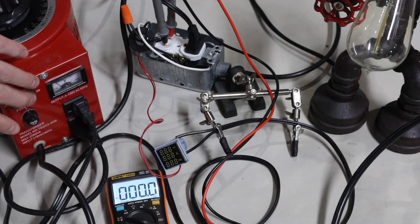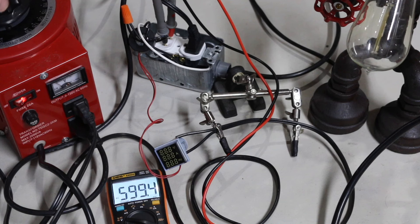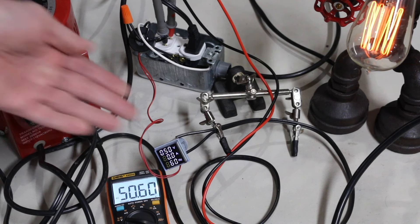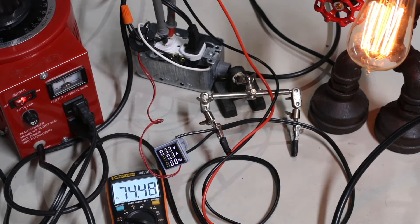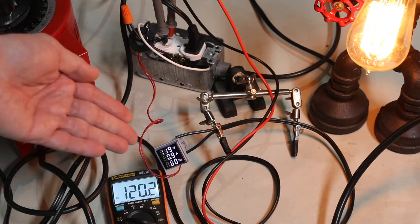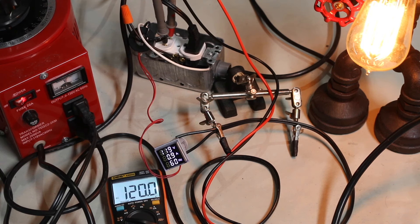Turning on the AC output - we're at 599 millivolts. Just over 20 volts and the panel meter is starting to come on, and the light bulb is starting to light up. 32 volts, 50 volts - the panel meter and the multimeter seem to be agreeing on the voltage. We have 60 hertz as well, but not enough current to show up yet. At 79 to 80 volts we're showing 0.7 amps. Going all the way to 120: we see 120 and 119 volts and 0.9 amps - close enough to the 1 amp I'm expecting from 3 loops measuring 333 milliamps each.